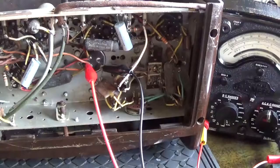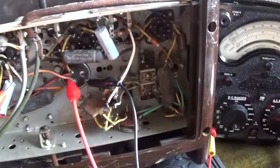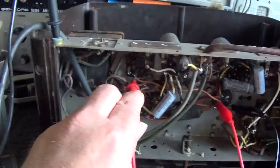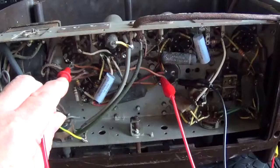I'm just going to measure the voltage on my Fluke meter. When I started off we were getting about 250 volts. I'm going to follow this orange wire across and probe that point there just to save getting in and possibly shorting something out. Measuring across there we're getting about 302 volts, which is much better - you want to see the leakage current come down and the voltage go up.